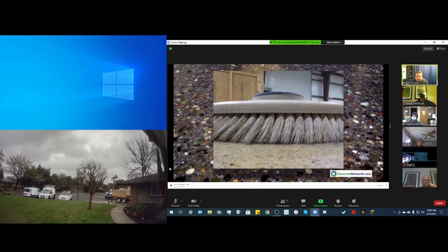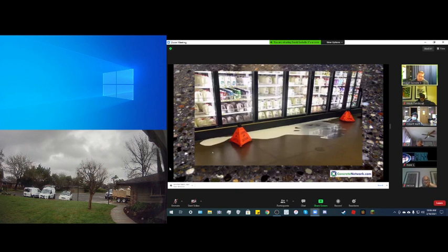As part of the preservation of polished floors, it is important to get any spills off the surface as quickly as possible. In this case, if the milk sits on the surface for more than 20 to 30 minutes, it'll slowly start to etch the concrete. That's the only real major problem of polished concrete, is polished concrete can be stained through acids. He's going to talk a little bit about that.